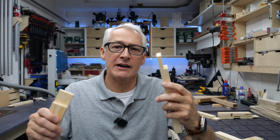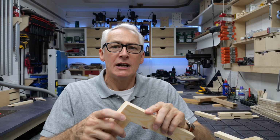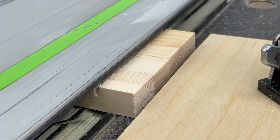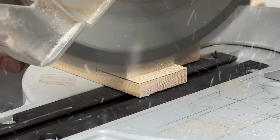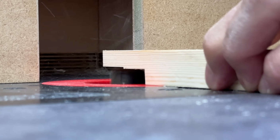So yeah, despite modern glues, you will get a stronger joint if you use something like a simple half lap. A half lap is exactly as it sounds, where you remove half the material thickness from where the 2 battens, the 2 sticks, overlap, and this gives a remarkable 3 times the gluing area of a simple butt joint. You can cut the half lap for an L joint with just a track saw. You can do it with what's called trenching cuts on a miter saw. You can do it on a table saw, sliding table or cross-cut sled recommended of course, or just on a router table, or any combination of those.